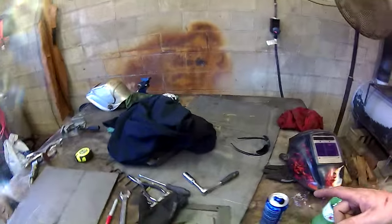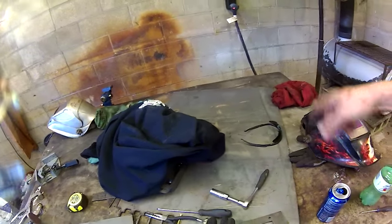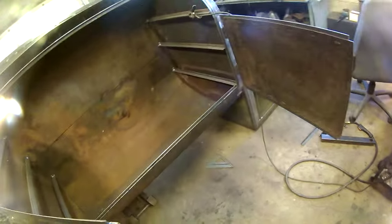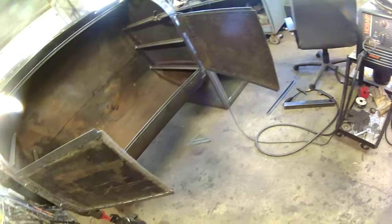I still have about 3 feet of good quarter inch plate from this that I can put in there, a 3 foot plate, which may be enough. It'll cover a good ways. I like using quarter inch plate across the bottom of that because it acts as a heat sink also. It's going to suck up the heat and keep radiating heat. And I think that's what helps with a lot of the even temperature.